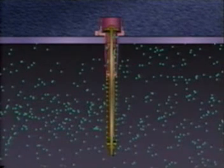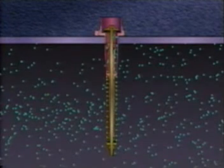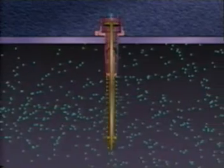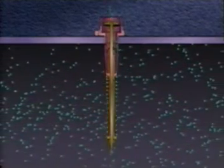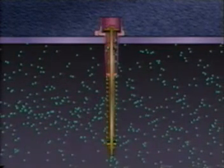However, if this initial venting of gas fails to control the pressure buildup and pressure continues to rise in the container, the seat disc will move to a full open position with a sudden pop, allowing a large volume of gas to vent from the container. When enough gas vents so that the force from the gas pressure falls below the force of the spring, the valve is designed to reseat and stop the flow of gas.